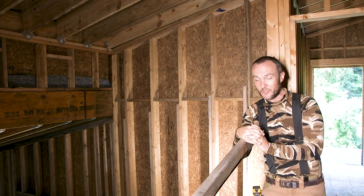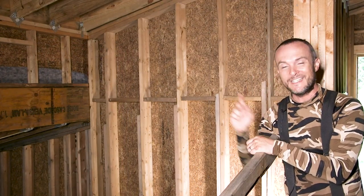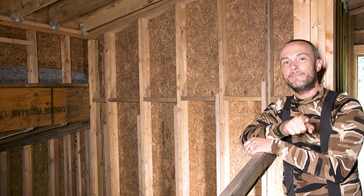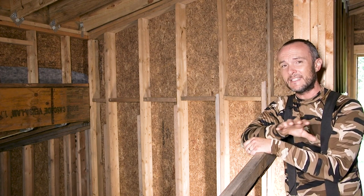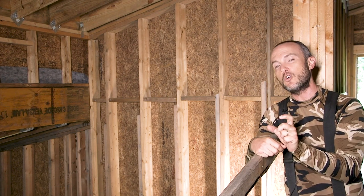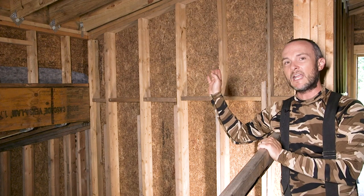Some builders would just overlook it and say it doesn't matter — but that's not true. Some might suggest spraying foam into that cavity from below, but we're not doing that for a couple of reasons. Number one, all spray foam — and in fact all foam insulation right now — has toxic flame retardants in it that off-gas perpetually into the surrounding air. So there is no spray foam in this house in any form. We do have a couple of areas where foam is used for a very specific purpose, but spray foam is off the table.